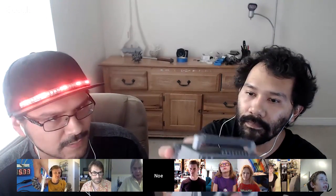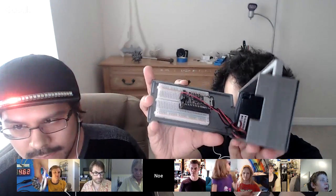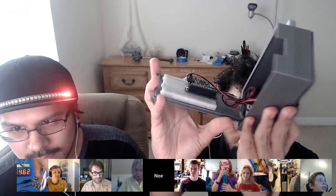So I put together a little guide that tells you how to do that. You basically print one color first, and then you do a little bit of scripting in your G code. You tell it when to stop and when to start, so you can have different colors stacked on top of each other. It starts with black, then gray, and then white. So just three colors to make Boomy. Cool. You can apply that to a lot of different things like logos to get different colors.